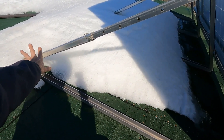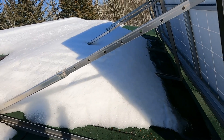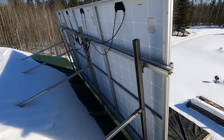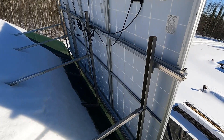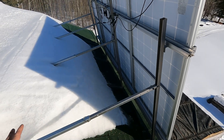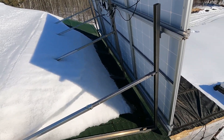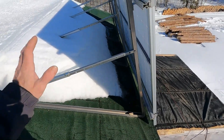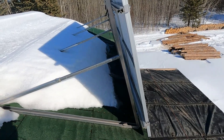I have approximately a 4/12 pitch on my roof, so that's where it lays back. If you get 15 degrees, the sun is high in the sky here in summertime, so you want the most direct angle the sun is going to hit the panels for the best power. Very simple — you can build these yourself or you can buy them. The racking was around $700. It bolts right through the roof. They're adjustable. If you're planning on putting them on your roof and want to get up a little higher, put adjustable panels on.